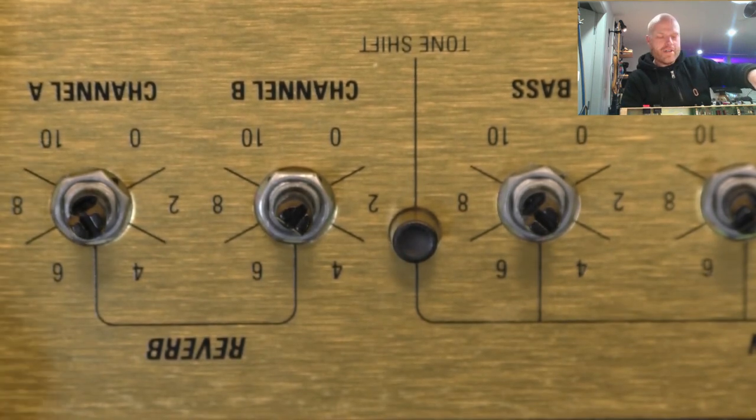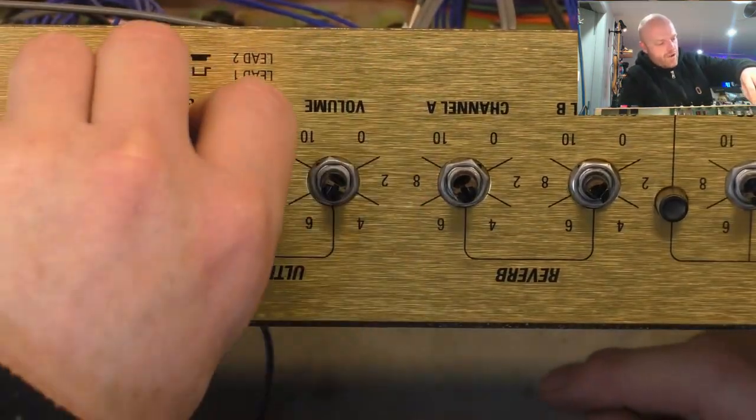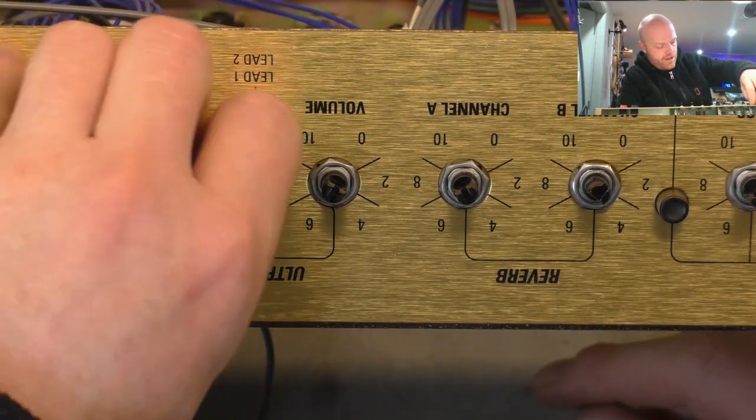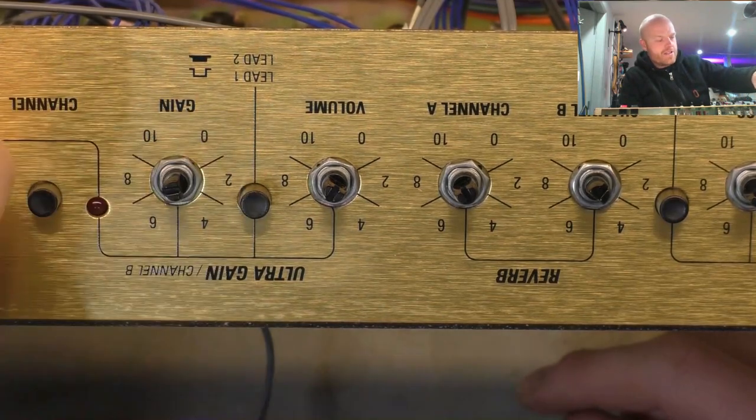So where was I? Point being, it's hard to get the nuts on the pot bushing straight and get them to thread on nicely. So you've got to really be careful when you're threading it on that it's actually taking to the thread.